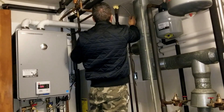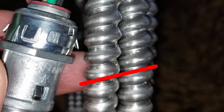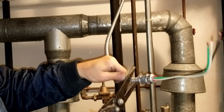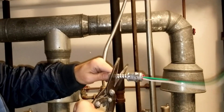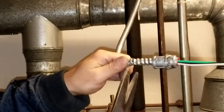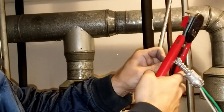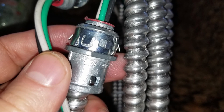This MC cable was a little bit longer — 15 feet — so we're going to cut it. To cut it, you get right in between the grooves, which is the weakest part of the cable, and use regular tin snips to force your way through. Because we're cutting with no special tools you need a little muscle, but it's not that hard — once you start cutting, the metal clad just breaks apart. Then use a regular wire cutter to get to the copper inside and cut it. We have successfully cut the cable and the MC connector is there to reuse.